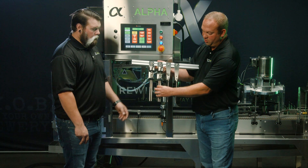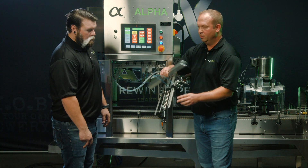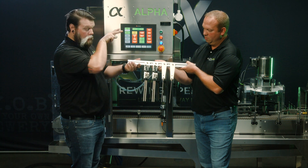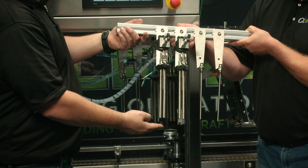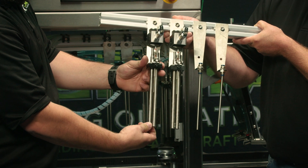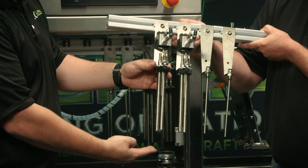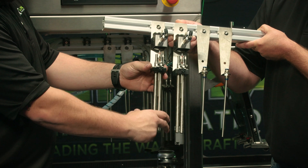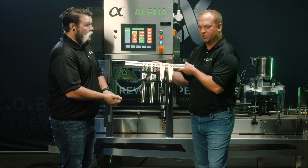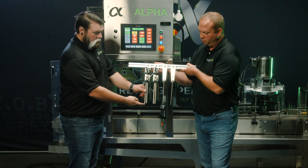To adjust your fill tube, first lower the fill head down into the can. You can then adjust by loosening the thumb screws and setting the height of the tube itself. The gap you're looking for is an eighth of an inch from the bottom of the tube to the inside bottom of the can — you should only be able to lift the can an eighth of an inch to contact the bottom of the tube. Through trial and error, we found that to be the most laminar flow, giving the most control over foam.